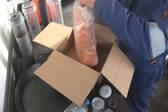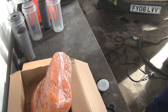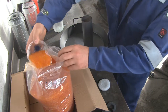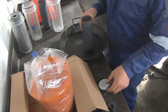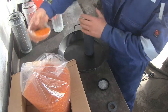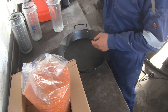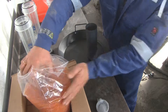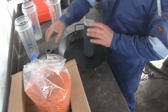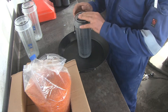I had to buy a new packet of silica gel, and as you can see brand new it comes beautifully colored in that orange color. To make a DIY moisture trap or moisture filter, I bought some water filters and took out the activated charcoal component. I'm replacing it with silica gel, and once I fill the capsules I put them back into the container with some silica gel around the capsule itself. The silica gel acts as an indicator so I can see how progressively the colors are changing within the canister, which tells me how much good-quality silica gel I still have remaining.